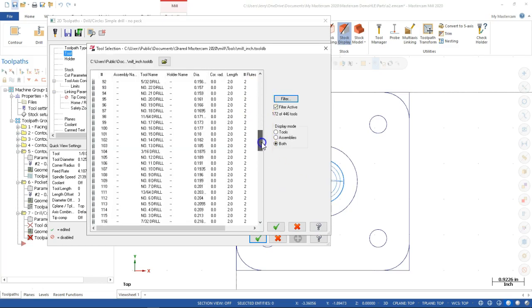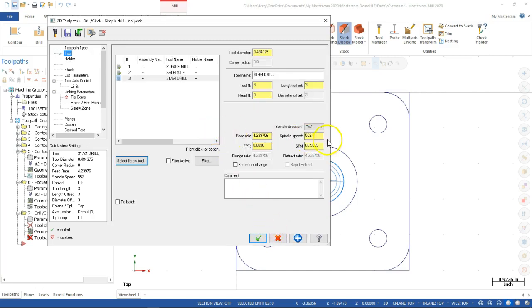For a half-inch ream, I want to be about 484 to, what do we have? 484 it is. All right, so that gives me a 64th lower. Usually say the selection is going to be 5 to about 15 thousandths under, and then we'll pick up the reamer. All right, so 200 on the surface feet will give me an approximate 1577. Yeah, I can probably live with that one. And then the 4 thousandths per revolution, let's just make that a nice even 12.